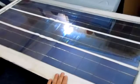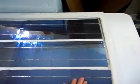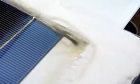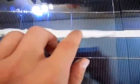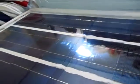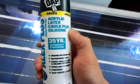Just like that, I got the glass on the solar panel. That's more like plastic sheeting. I have the plastic sheeting on the solar panel, as well as all my wiring complete. Right there's my power wire leading to the outside of the panel, and my ground wire right here going to the outside of the panel as well. I siliconed the plastic sheeting down all the way around the frame, as well as put a couple blobs here just to keep the plastic sheet secured. Yeah, that's pretty basic. I used the same stuff that I used to secure the solar panels down, the Alex Plus 35-year silicone and caulk.